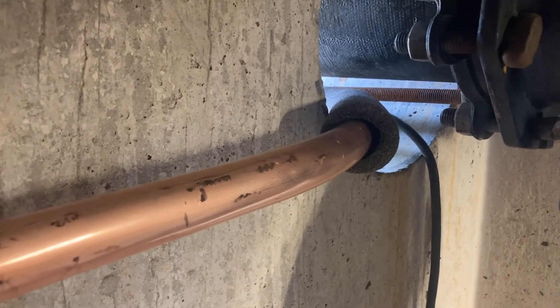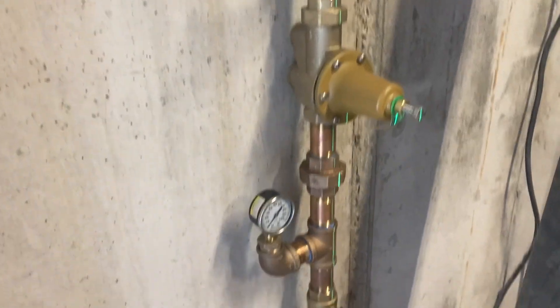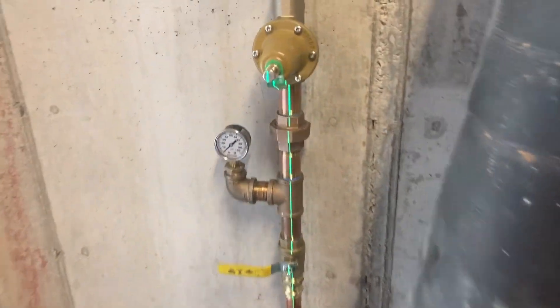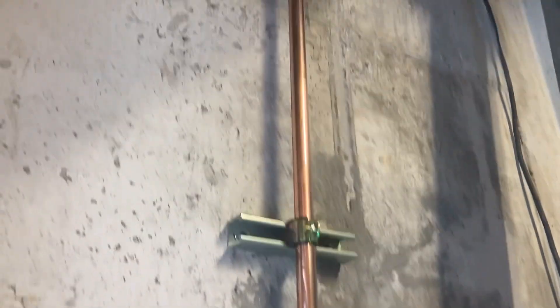Ian's putting the three-quarter for the outside hydrant in. We're making good steps here. Got the insulation going through — keep the pipe nice and clean when they cement this hole. Service is in the building. Got the PRV installed with our valves. We go down, back up the wall, over, through those holes that you can kind of see in the top right. Good progress. Everything's on unions so they can be disassembled and removed easily and replaced or fixed.